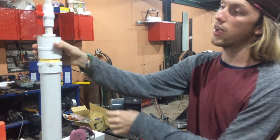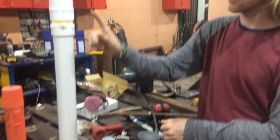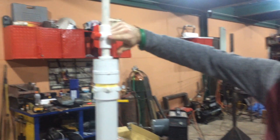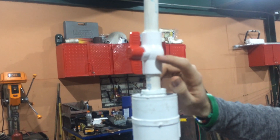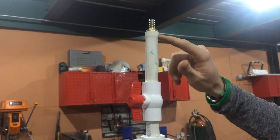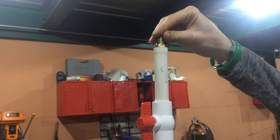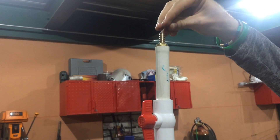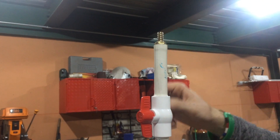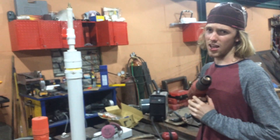Got a clog — I could thread off a fitting and stick a stick through to clean it out; unlikely to happen but it is possible. Up here we have a valve for turning the gas on and off to the tank, and here's another piece of pipe. We heated this up along with a brass fitting that connects to a propane hose or clear plastic hose, then threaded it in while hot so it made its own threads. Pretty easy — a little trick for you. Milwaukee heat gun saves the day.